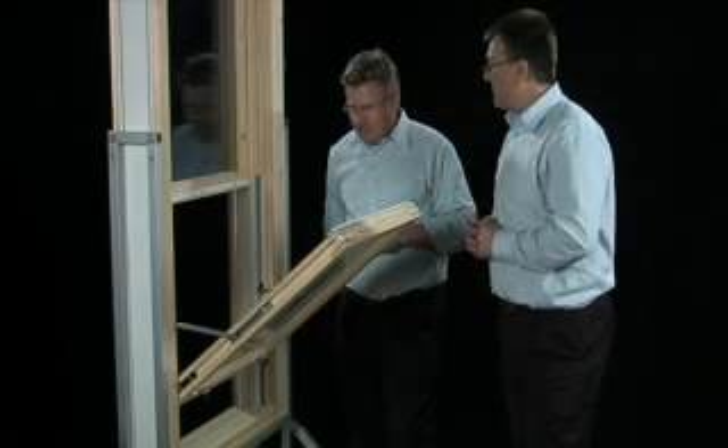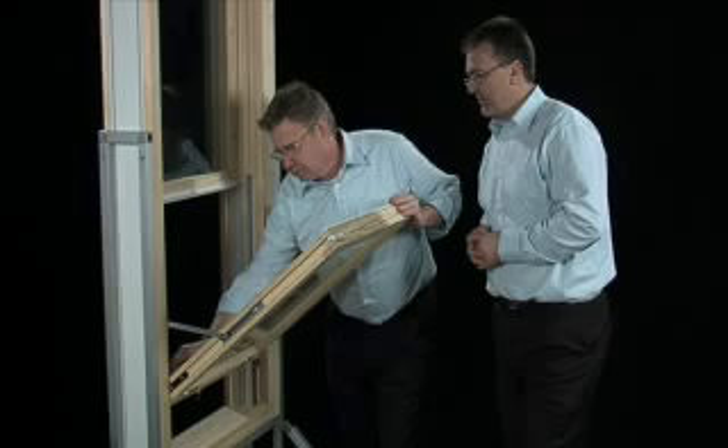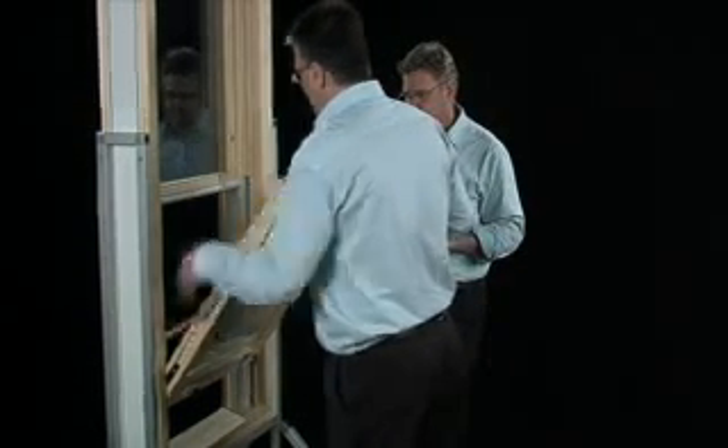With UltraShoe, you simply put a screwdriver in the slot and turn it clockwise or anti-clockwise, depending on the type of balance you're using, and that will add tension to the balance. And that is it. There we go — job's a good'un.